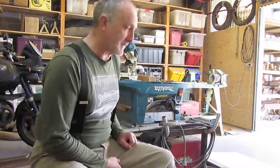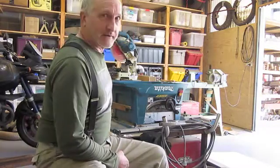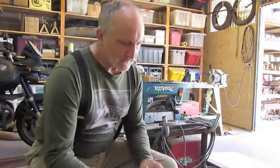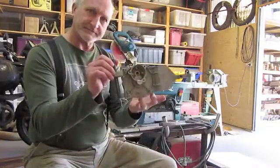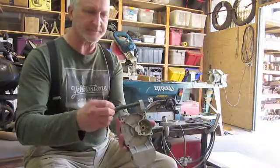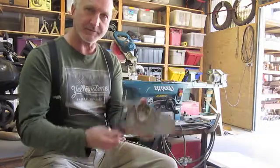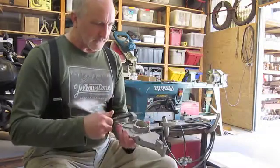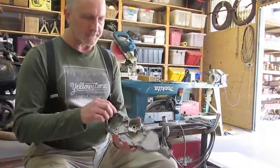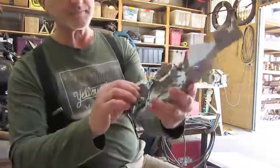I bought it a few years back. The first thing that went broke was I couldn't adjust the blade up and down. That's because of this thing called the gearbox. It's stripped out. This is a little screw you turn to make the blade go up and down, and it's relatively inexpensive to replace. About 50 bucks for the bolt, the plate, and a little bushing in there.